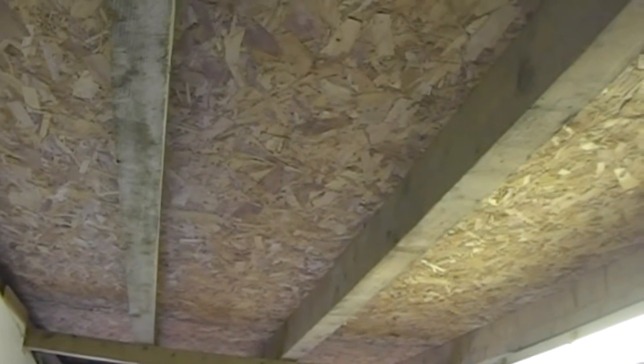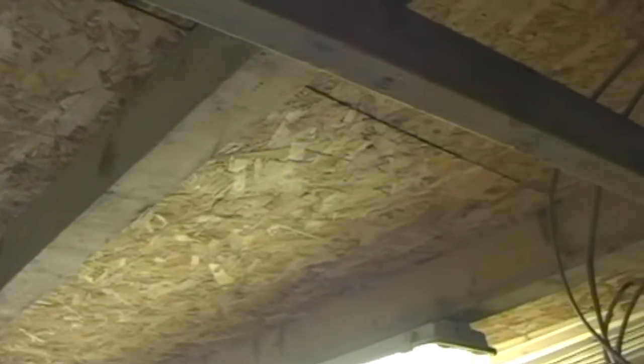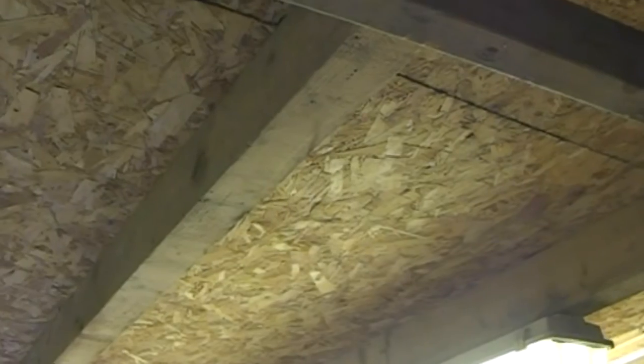If there's a problem with the roof, at least I can identify it straight away, because I'll see damp patches coming through. And the roof is EPDM rubber sheet, and then I've got corrugated galvanised iron on top of that. So in the 8/9 years it's been up, it's been okay. Touch wood. So I think I'm going to leave it.